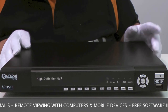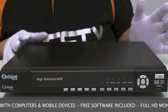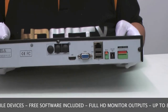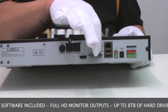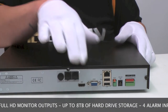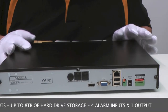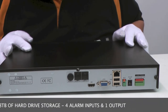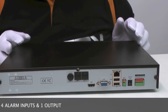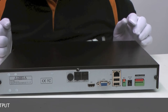There is a separate video showing you how to set this app up and use it — very, very simple. You can view your cameras all recording on an HD television connected directly to the recorder using the VGA socket here and the HDMI one there. It gives you full 1080p high definition resolution and it looks fantastic. Inside we have space for 2 internal hard drives giving you a maximum of 8TB storage, which is approximately 1 week of constant recording on all 9 cameras at 1080p, recording at 25 frames a second.